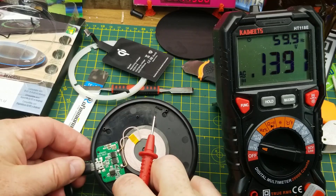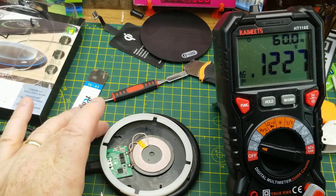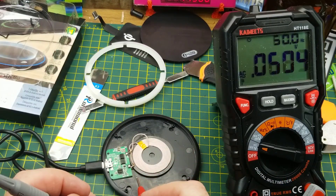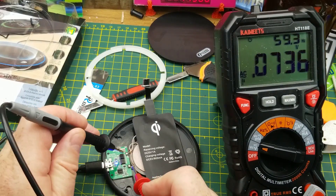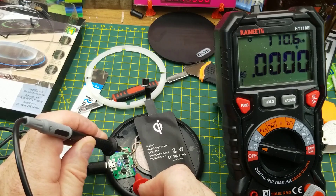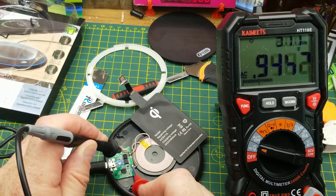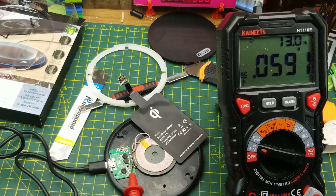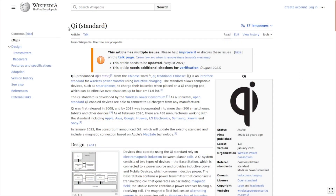When we plug this in, a couple of LEDs flash — which is interesting because this is completely opaque, there's no way to see them through there, and the LEDs aren't near the translucent piece, so they don't really do anything visible. When we put something on there that it recognizes, the LED turns blue. There should be an AC signal on there at 110 kilohertz, which I think is reasonable for the Qi standard, but I'm not reading any AC voltage — maybe this meter just can't read voltage happening in the kilohertz range.